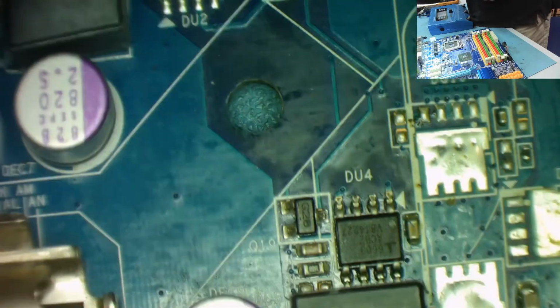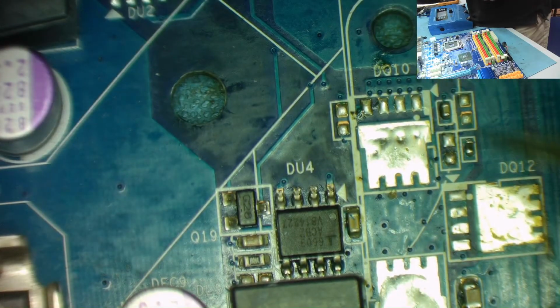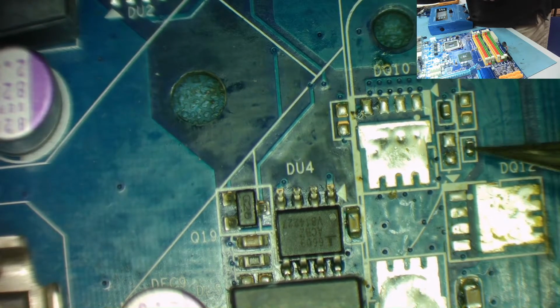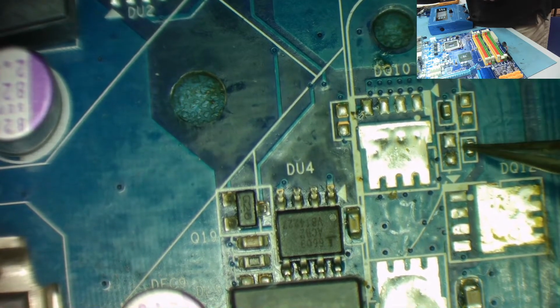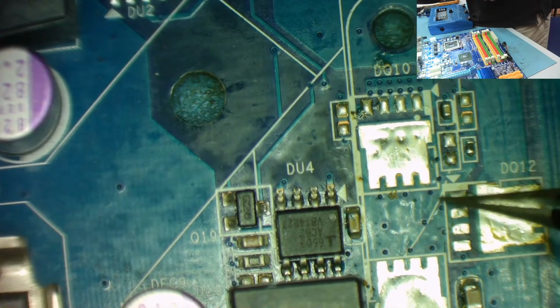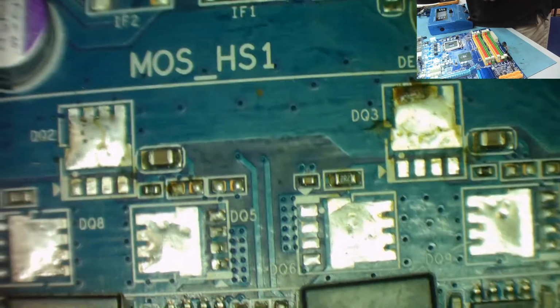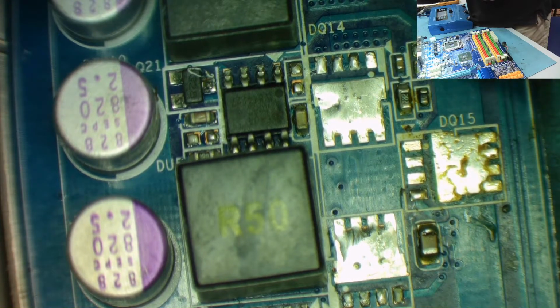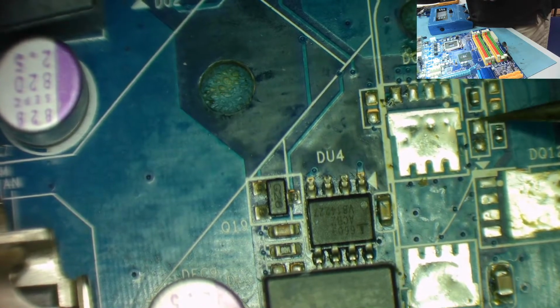So this is the first group, high side, 2 low sides. So we have the big capacitor, the black thing, and the capacitor. There's probably a resistor missing here somewhere, because they had them on the top here. They had these 2R2s, and this doesn't have one. So the next one below it will probably tell us better. Okay, I can see it as well. So capacitor, 2R2, and the little black thing and the capacitor. So we see clearly that here should be a 2R2 resistor, 2.2 ohms.